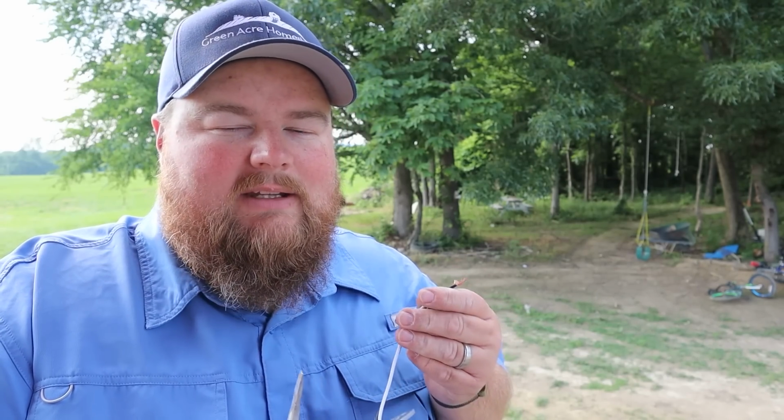You guys saw me do the other light down there, so I'm gonna go ahead and do this one here at the other corner. Exact same way. The only difference is that there is going to be an extra set of black, white, and green wires in this, since this is a junction box and not just the end of the line. So we'll go ahead and skip ahead, get this thing wired up, and then we'll start doing the next step. Bulbs, plug it in, and of course, that X factor.